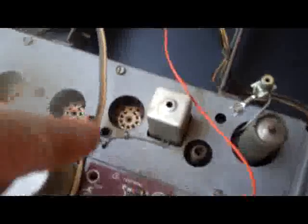I've installed an RCA for the composite video input and actually soldered everything into place. I removed the IF tubes and the audio tubes because they don't need sound, as well as the tuner tubes, to reduce the load on the B+ and transformer. I'm going to fuse the horizontal output cathode and the line going into the power transformer as well as the B+ coming out.